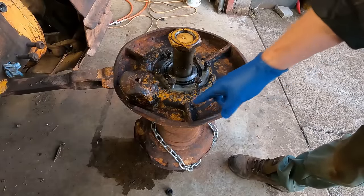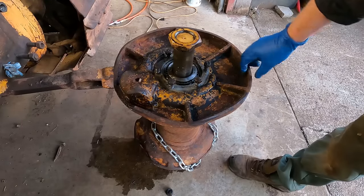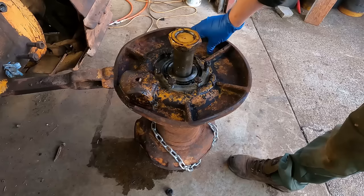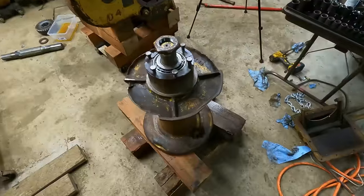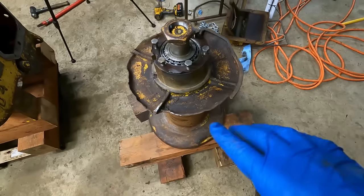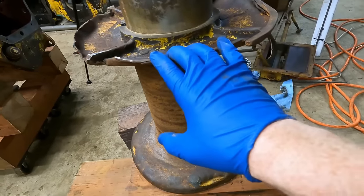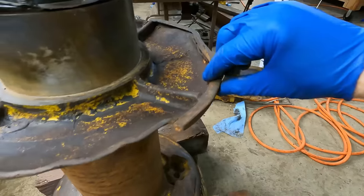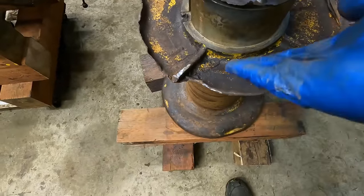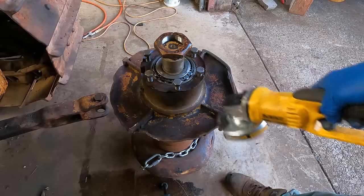This is the good side — you can see how the casting is. There are thick spokes that come out, then a thick piece of cast steel around the outside, and the rest is pretty thin metal, maybe an eighth of an inch. On the bad side, we have four spokes. Fortunately the spokes are in place, which is good because they provide all the strength to keep the cable from coming up and falling back over — that would be a catastrophic failure. However, about a half-inch by half-inch section has cracked off and the skin's folded back on three sides. I'm going to run the grinder on it and look at the sparks to tell what kind of steel this is.